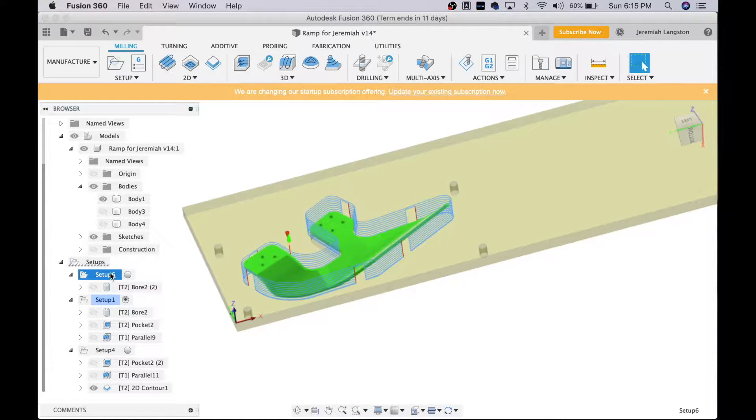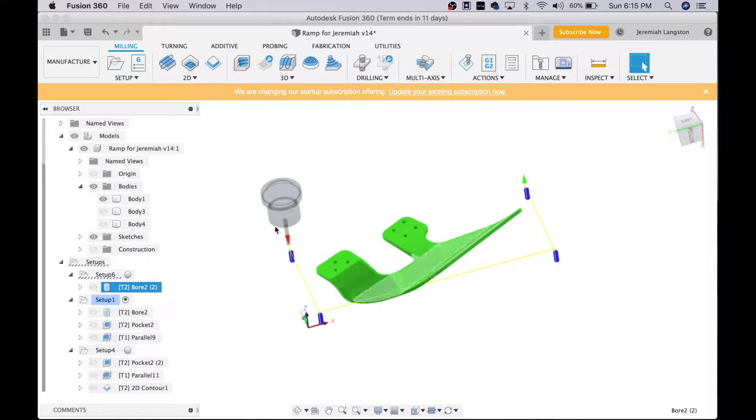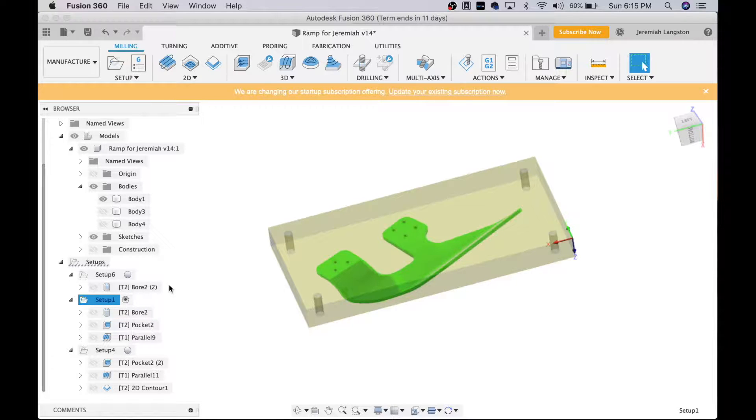So the first thing I do in this setup is machine the holes into my table — I just have an MDF surface on the top, I'm going to drill these holes in and I've figured out exactly how big they need to be to accommodate the dowel pins. Then I take my starting block and locate it in nearly the same location, then come in and drill four holes in it. It really doesn't matter if it's exactly where it needs to be, because drilling these holes in the starting blank establishes a relationship between my tabletop and the part, and so it doesn't need to be exact.